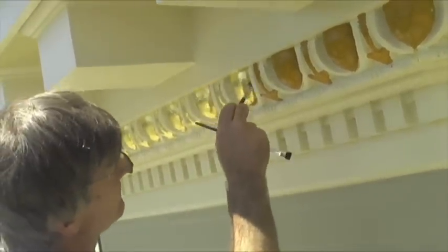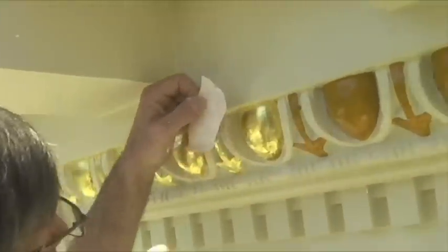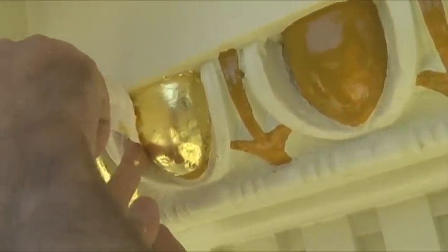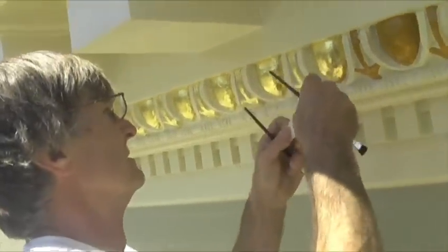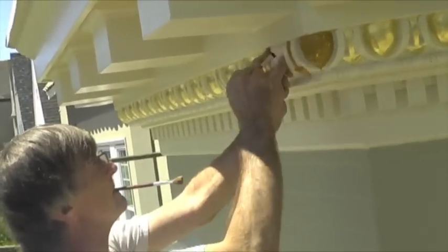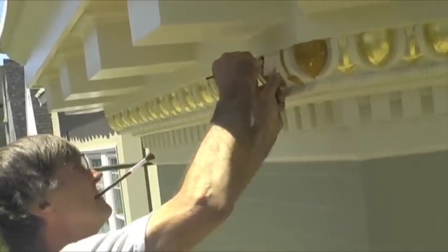This brush is to brush off the little gold pieces so I can see the spots I missed. The sizing is pretty impossible to get a perfect edge with — you're going to have to come back in and cut some of these little details. A lot of times the gold tends to stick to the paint itself, depending on how fresh the paint is. I put the sizing on at nine, so it's been about two and a half hours now.